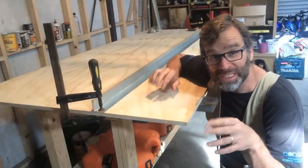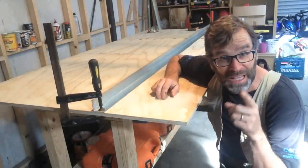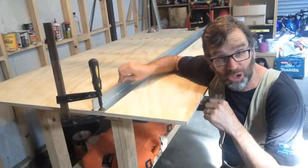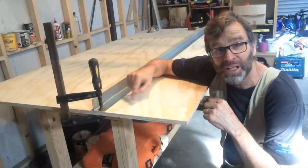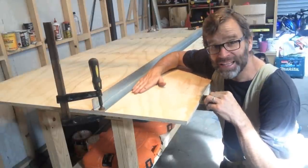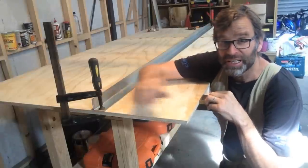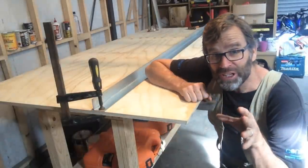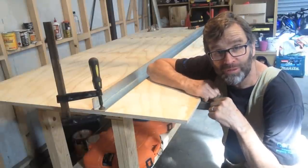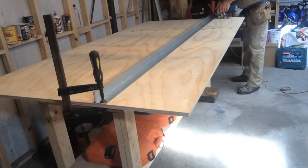Now when it comes time to cutting the plywood for the grind box, here's a really good tip. Get the coping that you're going to be using for the grind box and clamp that down to the plywood. That way the base of your saw can run hard up against that edge, giving you a nice clean cut. And if you're not very confident in doing that, you might be able to get the hardware shop where you bought the ply from to cut it for you.